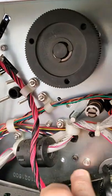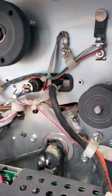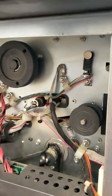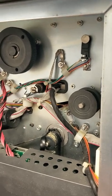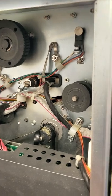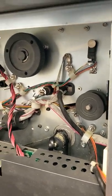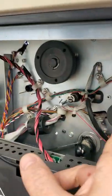This rewinder belt is shredding as well. If you're getting jams you can actually stretch the belt enough to stress it — you'll see stretch marks in the belt sometimes, and that'll cause skipping of labels and movement of the platen roller without the material moving because it's slipping where the belt has been stretched.